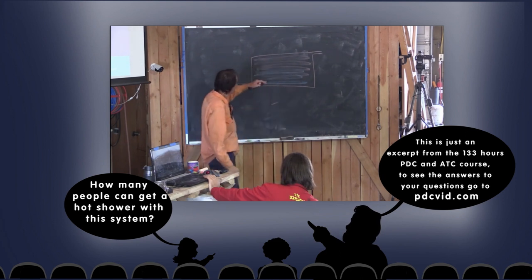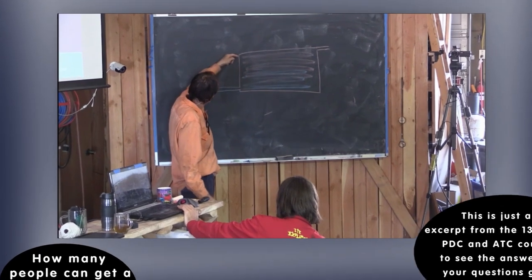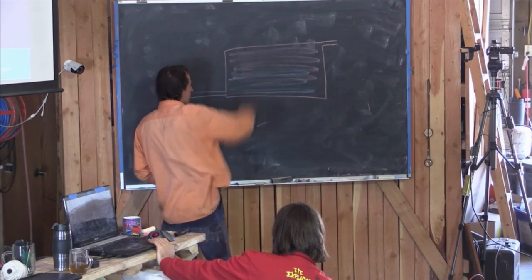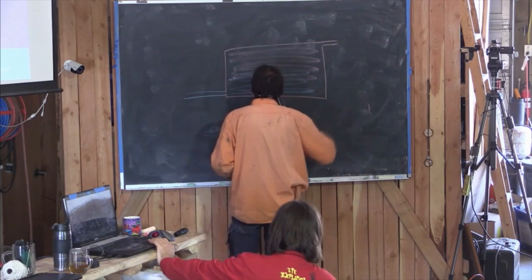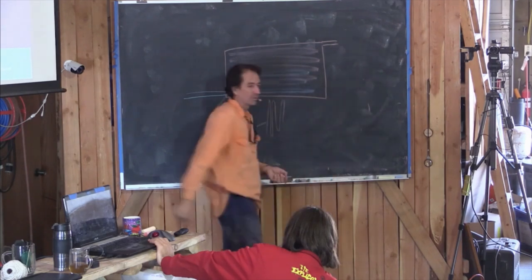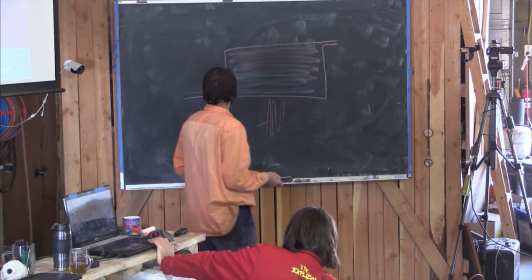So that we'll get longer hot water. Instead, if it was at the top and it mixed instantly, we would get lukewarm water straight up. This will tend to maintain a heat differential a lot longer. Just imagine a rocket stove below this applying flame, and this heats. If it's open, then it boils so we don't get any pressure build up. So no boom, no squish, nobody gets hurt.